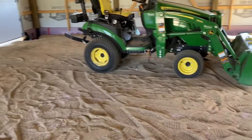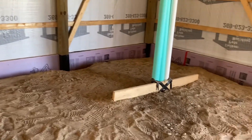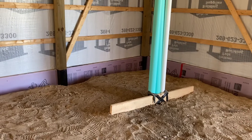I still don't have the doors done because I need to wait until after we get the grade in here done. My concrete guy is going to come in and do a final grade on this sand floor. Once that's done, I can dig out shallow trenches and put in the plumbing lines for the bathroom — shower, sink, toilet — plus shop sink lines and drain lines. I'll get my plumbing inspection passed, bury that back in, get it all tamped and nice. Then I'll start putting the floor insulation in, lay the hydronic PEX pipe on top of that, throw a vapor barrier in, and then we'll be ready to pour the concrete. Finally getting some progress and starting to feel like I'm close to the end. Thanks for watching.